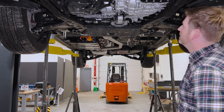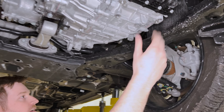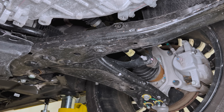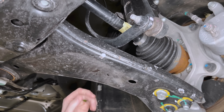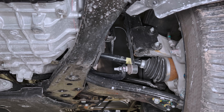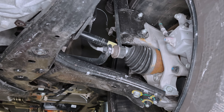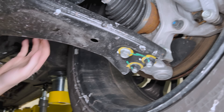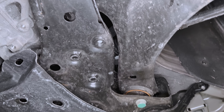Being roughly a one kilowatt-hour battery for the front as well. As we come through here, you'll see steel clamshells, reinforcements, welded through to pick up your lower control arms — those are also clamshell. On our EV9, we saw a lot more aluminum used throughout most of the chassis components in a virtual ball McPherson setup. This is a very traditional McPherson setup with serviceable bolt-in ball joints. Most of what I see from the motor bay rails and front-end structure looks very similar to the EV versions.